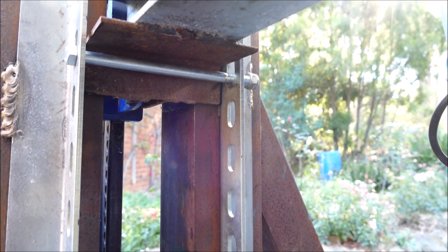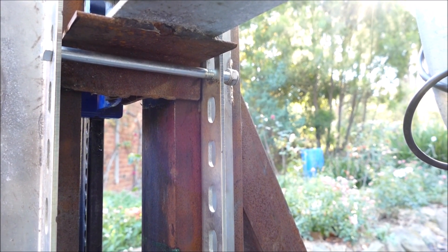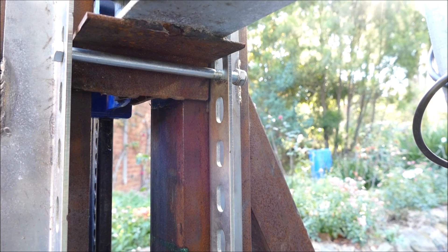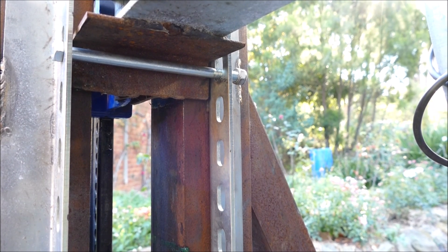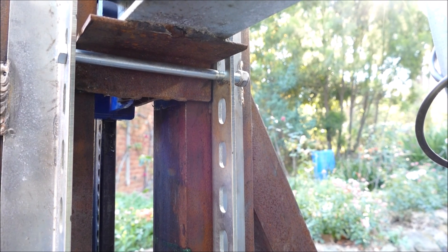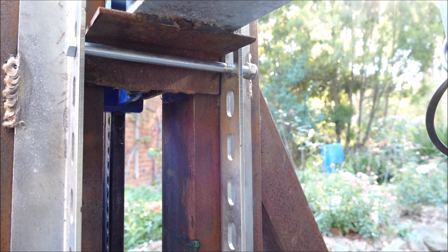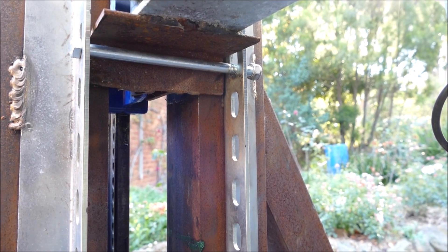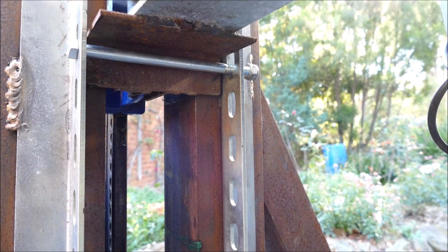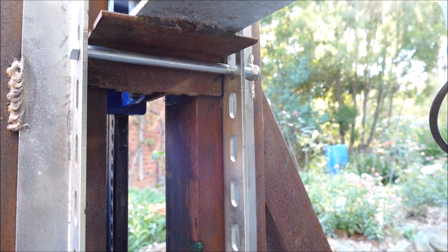You can see the bit of angle that's welded to the base of the supporting beam, that runs up and down the face of the stand. The angle itself fits between the two slotted angle uprights that I've welded onto the stands, and also locks the bolt into position if the stand should fall — so it hooks over the bolt and will hold the stand to the beam securely. Before this we had the jacks lifting the stands with not much else, so now we have a backup system that will allow the stands to work safely even if the jacks fail.